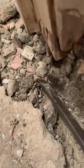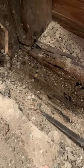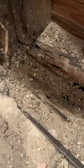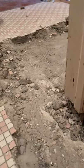There's a whole other layer of mortar attached directly over the wood floor. They took mesh, nailed it directly to the wood subfloor, and poured a mortar bed over top of it. Then they poured another mortar bed and affixed the tile to that. There's probably a good three and a half to four inches of tile, mortar, and sub-mortar before you actually get to the wooden floor. That's what we're working on today — getting this floor up.